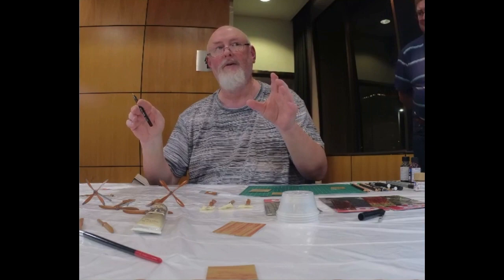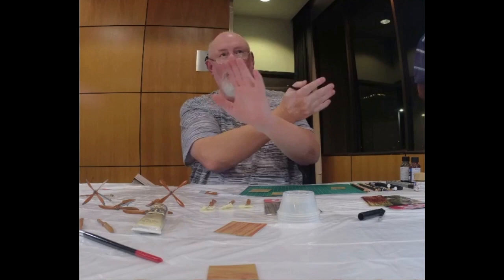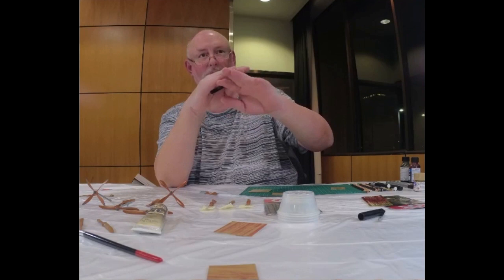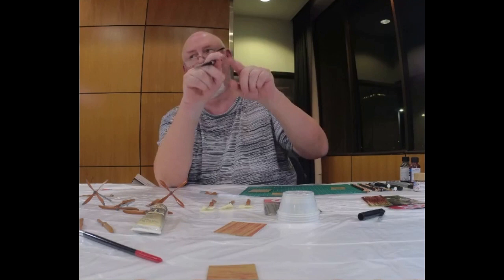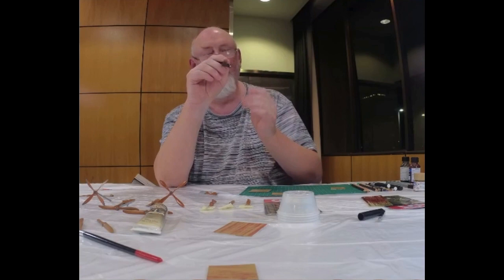It is never ever cut this way — that is a stump end, so if you're looking down at the top of the stump it's cross-cut. So you won't find a veneer with a cross-cut on it, because they're laminated surfaces like carbon fiber or fiberglass. They laminate, they glue them together. The grain, when they put panels on it, will be north-south or east-west — it won't be 45 degrees. It's north-south, east-west however they put it on, but not at 45 degrees in any rotation.